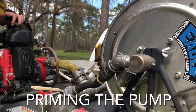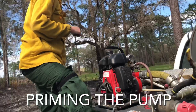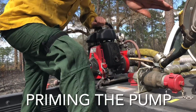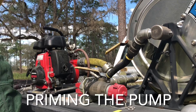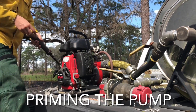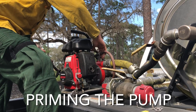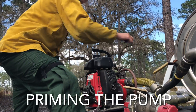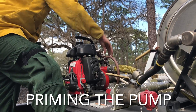So we close the pump-to-tank valve — our recirculator — and open up our hose reel, making sure the nozzle is open. This gives our water a way out while we're starting it. But before we do that, when you are priming you only want the priming valve open. The sequence is: close your recirculator, close your hose handle, open up the priming valve.